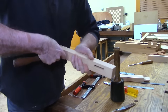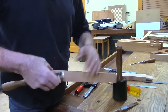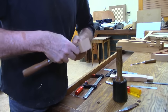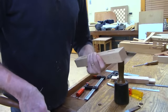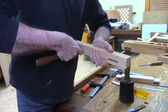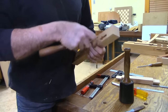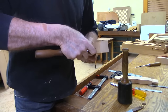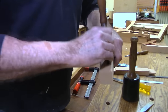You want to talk a little about using a plunge router to do this? I did earlier. That's a method you can also use. It's just a method where you have to set up some kind of controlling fence so you can plunge and then move across. In some projects, I have used a plunge router. And I think on the Adirondack chair project, I used a plunge router using the guide collars in a pretty creative way to make some floating tenons.